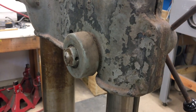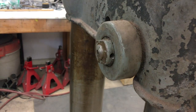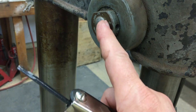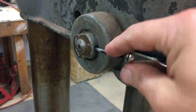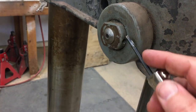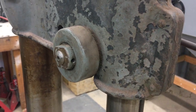If you've seen my other videos you know that I make assumptions and find out they're wrong — so this is probably still wrong, you might want to watch the rest of the video. General rule: anything on a shaft, I need to always look really close. I tried turning this with a wrench and it moved, but it wasn't really coming off, so I don't think it's threaded. I think this has something to do with turning the spring — when I undid this, you can see it turns all by itself and the handles turn too. So I think this is just held in one position, and that's how you get the spring tension. In theory we could turn this, undo it, turn it all the way around, and then pull it out.